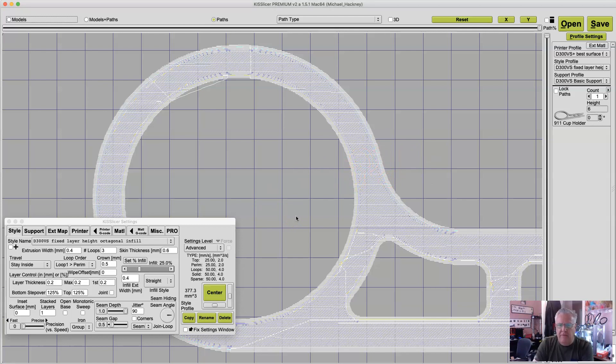Sweep takes more time because you're traversing this large opening at 15 millimeters per second, which is pretty slow. Grouping constrains all movement to the top of the part, so it's faster. Your mileage may vary — it depends a lot on the part geometry, the material, and the speed. You can change the iron speed in the printer speed tab to maybe offset some of these things. But for me, I don't mind spending a little extra time to get a superb part, so I'll probably stick with Sweep and occasionally experiment with Group. If you're not concerned about time and want the best part you can get, I think Sweep is the way to go.